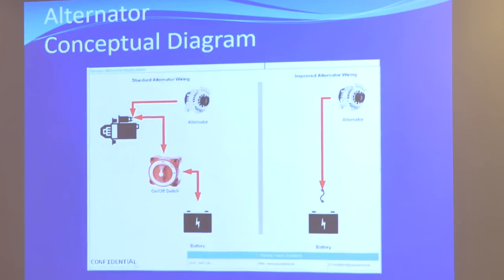Your alternator is going on the same short little wire that goes to the starter post — it's not literally the starter post, it's the solenoid post, but for simplicity it's the same thing. And then it connects to the battery.